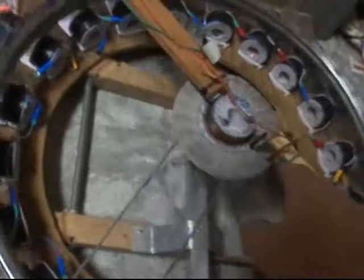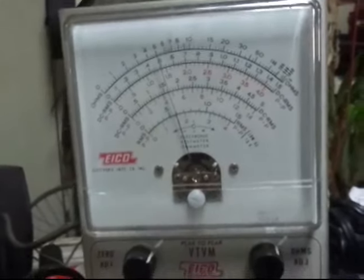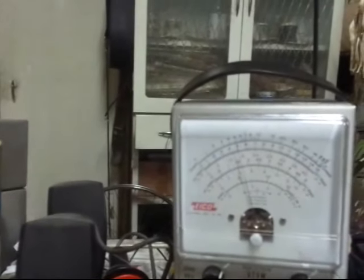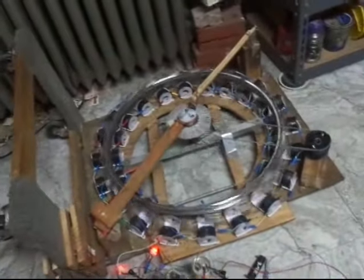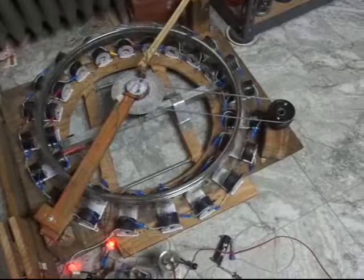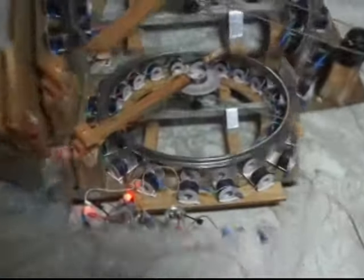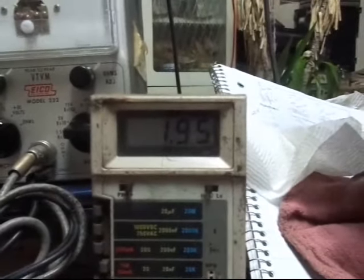I lowered the brush — it's now contacting. That's the brush if you hear that. But we are down; we're at 500 volts pulling 1.9, almost 2 milliamps. That thing's still pegged. So there's the difference, but it runs faster. Shut that down. Apparently it's peaked at 450 volts.